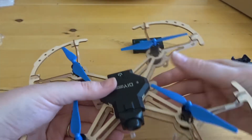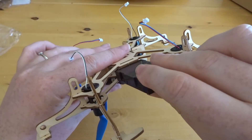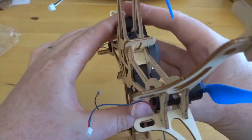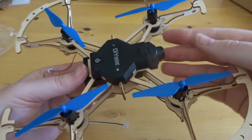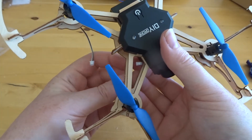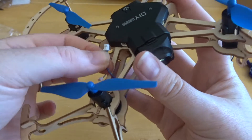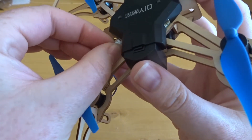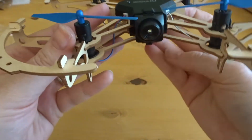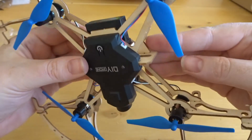There's no cable to connect with the camera — it's just a solid port-and-socket affair, so once you clip it in it is connected. The battery then goes in one way: the back end of the battery clips into that little slit in the back of the wood, ensuring the battery doesn't fall out when you're flying. A lot of thought has been put into this — it really is a kid's kit but I really enjoyed it. Then it's just a case of connecting the plug into the socket for each of the motors. Total time to build: an hour and a half.